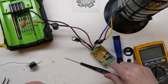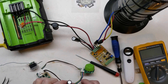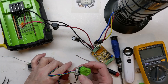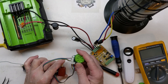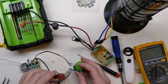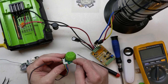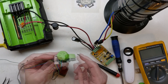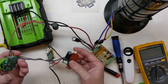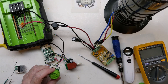Now I just have to figure out how I want to do the external potentiometer — we can do this any way we want. We can make this handle start and control together, or do it however we want. I'm going to finish cutting this loose and see if there's any way I can easily tack onto the potentiometer portion not going through the board. If not, I might just use the trigger itself, since I know it's zero to five volts through it.